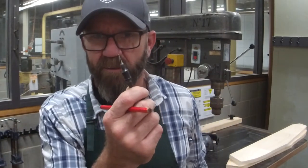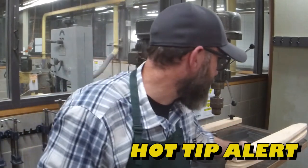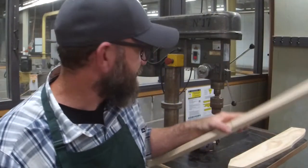I've got my countersunk bit, and I'll show you how to set it up. But also, once it's set up, I'm gonna leave it because we have to countersink quite a few holes down the track as well. It'll save a bit of time, and I'm countersinking these now because I'm going to lose my markings if I go sand it. So we'll countersink them, then I'll start sanding.